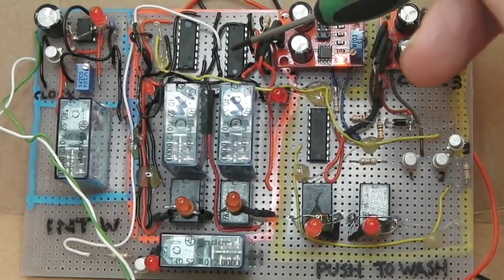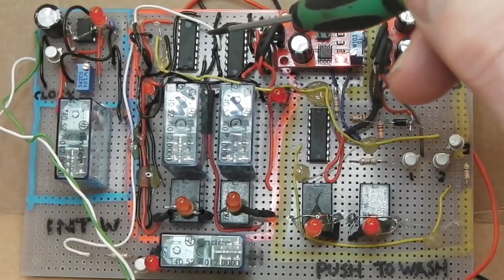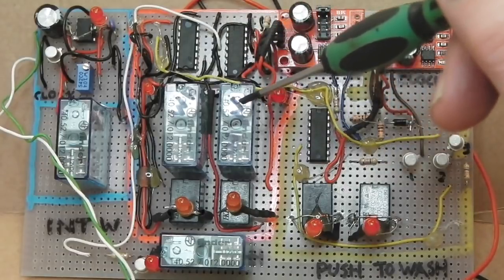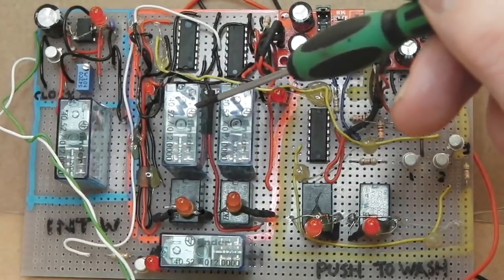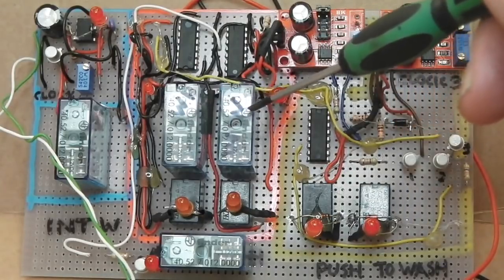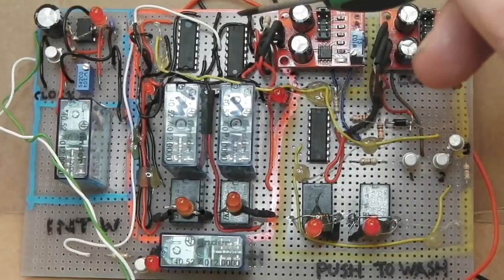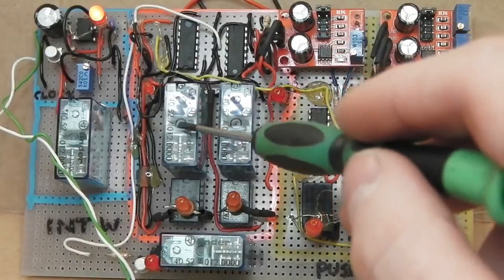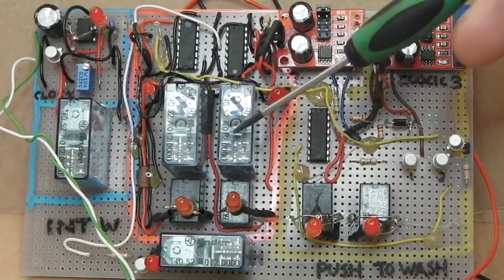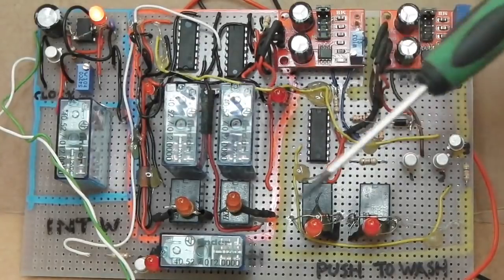Then when it gets to the third pin, because 2, 4, that's 6 seconds on the third pin, this would then click off, and perhaps we'd like a 2 second break before it does one more burst of water, then going through it again, then perhaps a 6 second break. If you've not run out of digits, you can get it to do the post wipe, which is that relay. So that's how I did it. 2 bursts on here, waits a little bit, then a final dry wipe there.